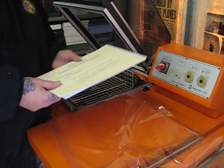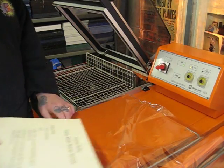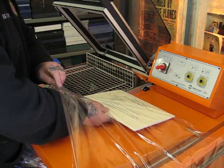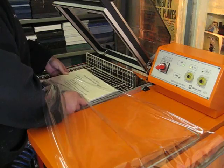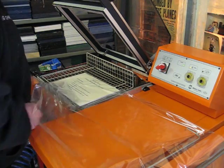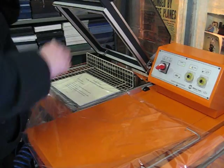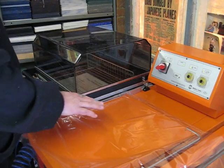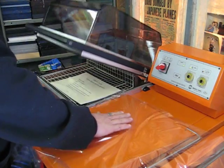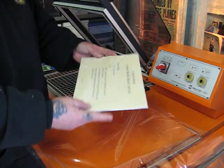So this is our backing board, with our pack on top of the backing board, into the film — one hand outside, one hand inside — put across to the sealing area, don't leave too much film. The film we're using today is a 19 micron polyolefin. Bring the hood down in one operation, firmly, nice seal, ease the film away as it's sealed, then you get a reasonable pack.